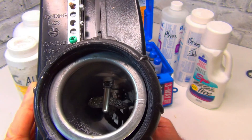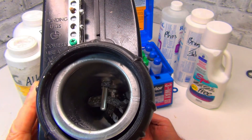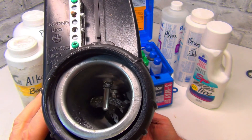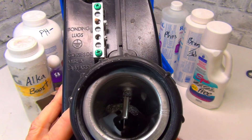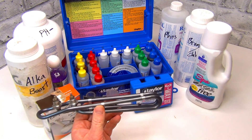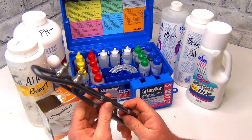See those marks on there — the white stuff? This element was brand new, and 30 minutes later it tripped the breaker. Really bad well water. It was running for about 30 minutes, tripped the breaker, and I opened it up and that was all stuck to it. That element wasn't a titanium one, it was just a standard element. This one here is the titanium, and the metals won't stick to it — they'll go right by it.